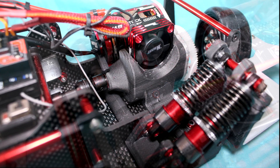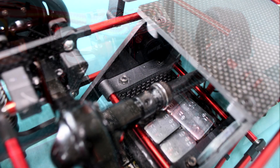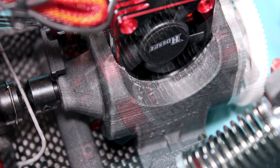It's an interesting filament because of the way it reacts in quite thin walls. It's almost like a wood filament where you've got the wood powder which seems to take the percentage of plastic down, which actually makes it quite soft in areas. But in thicker areas it's quite solid, so it's a very interesting material to work with. You almost have to design your parts to suit, because with a bigger nozzle your walls are going to have less layers around them.